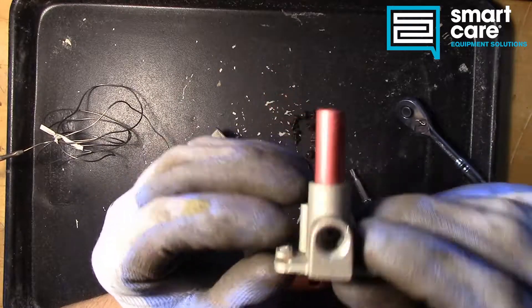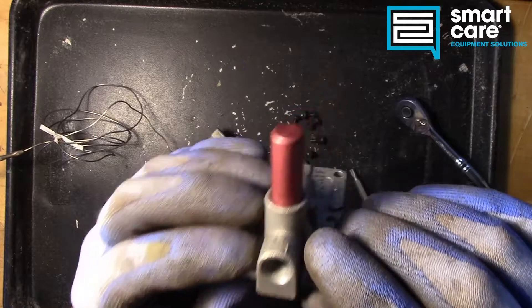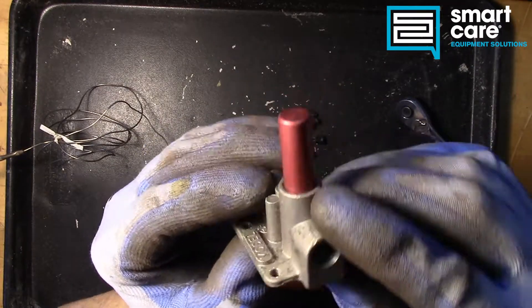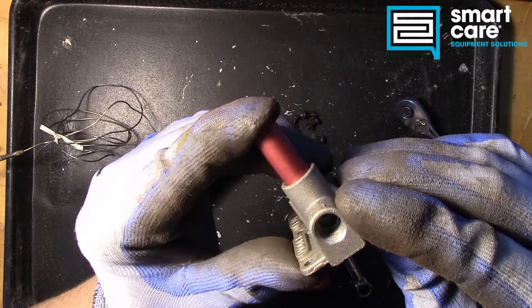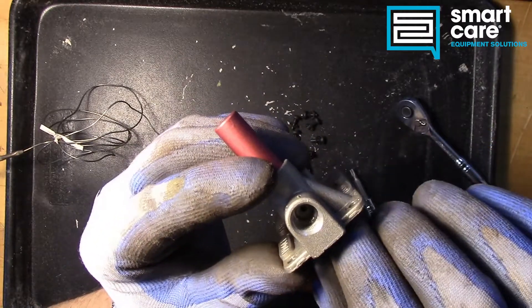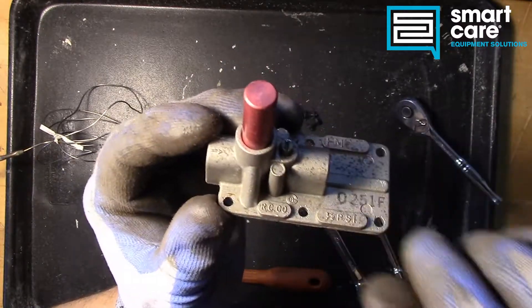What I'm going to do is hold this up by the camera and blow into the back inlet so you can hear what the flow sounds like as it moves through the valve. You'll hear first no flow, then full flow with the button pressed in, and then the limited flow with the valve released. That limited flow is regulated by the screw here.